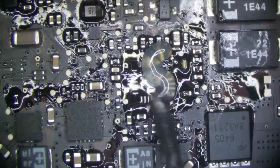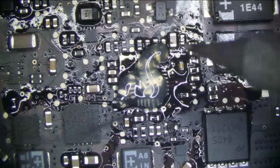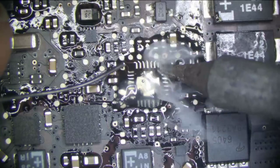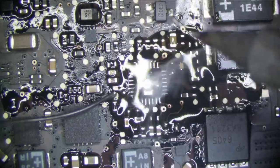So a MacBook won't send error complaints if I output a different voltage? It will. It absolutely will in ASD if you run the test. If the voltage is above 16.5 or 18.5, depending on the machine, it will pull a DC in voltage sensor above high threshold. But usability wise, it'll be fine.